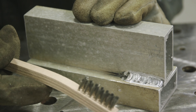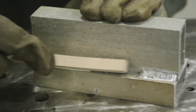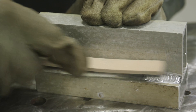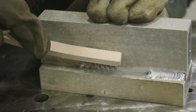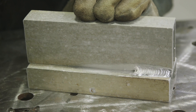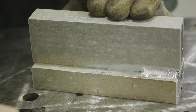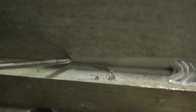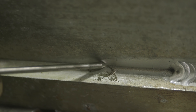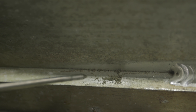We're going to clean this up improperly with a stainless steel wire brush. Most people get in there and start cleaning, but what I'm actually doing as I rake back and forth is — as I'm pulling these oxide layers off one way, I'm jamming them back into the material the other way. So I still have aluminum oxide going into this area. Here's that oxide right there — see all that black peppery stuff? That's what ends up in your weld, solidifying on the top once you're done.